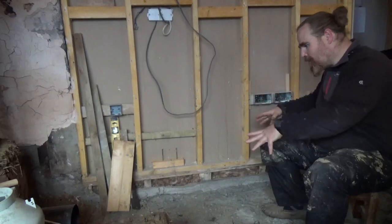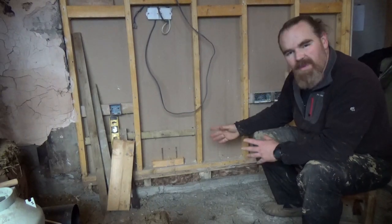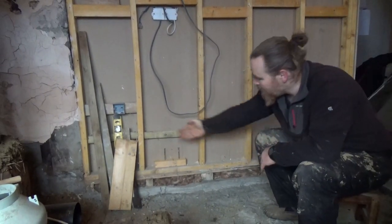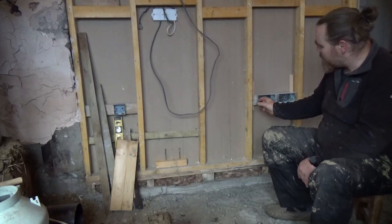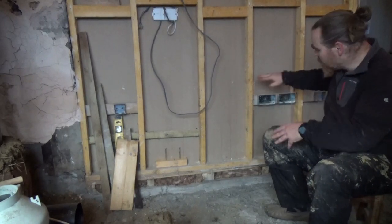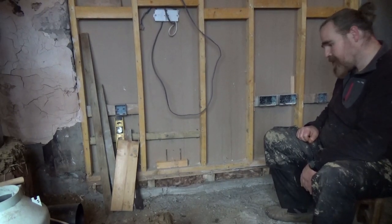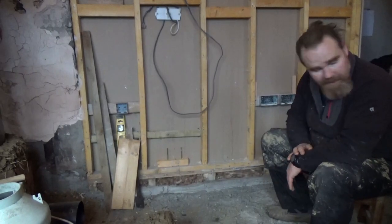I need to do all of that before I start work on the back wall, because up to here it doesn't matter at all. I could just use cob, but I'm not going to — I've got more brick than I actually needed, I overestimated how many we'd need. So I'm going to use that brick to build a low wall. And also because this is going to be a heated bench, I'm going to put a layer of insulation behind it to avoid putting too much heat into this timber work. I've got a couple of bags of clay-stabilised perlite good to go.